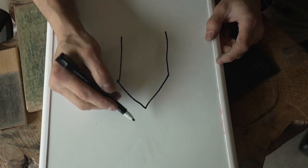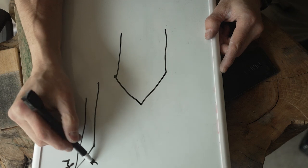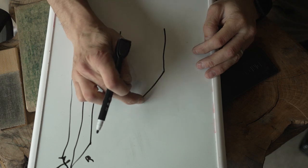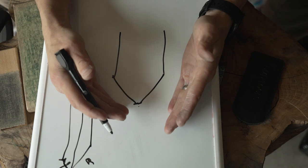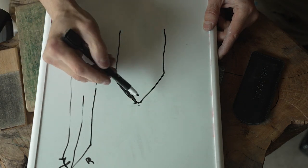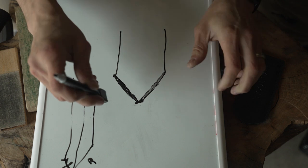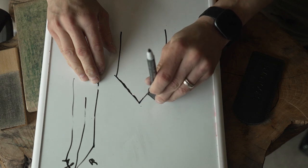It's not Scandinavian per se, but if you had a chisel shape like this, where you've got the flat side and then you've got an angled side — that's a Scandi grind. But the idea of sharpening — if you get a nick in that blade, suddenly you've got a rough edge on there. One reason why I don't like Scandi grinds a lot is you've got to remove all of this material here. If you want your blade straight and your tip straight, you've got to remove all of this material and get the Scandi grind back, and then you've removed that material on those sides and you've got your point back.